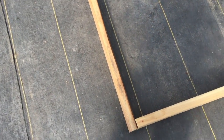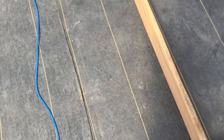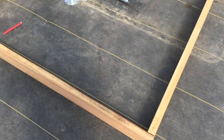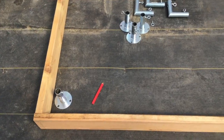The one on this side is 60 inches. These here are 57 inches, and that's because 2x6 is actually 1.5 inches thick. So you make a square base. It doesn't have to be perfectly square at the beginning — you'll end up squaring that up later.